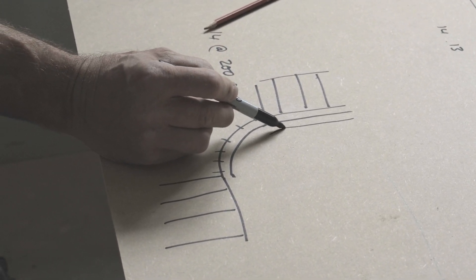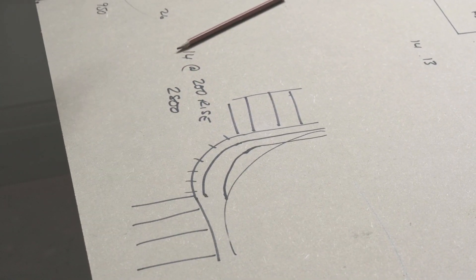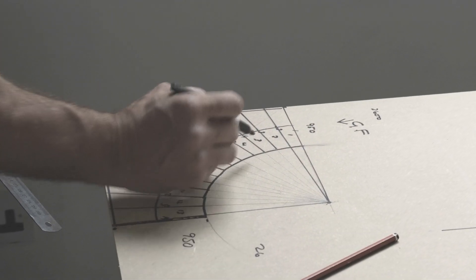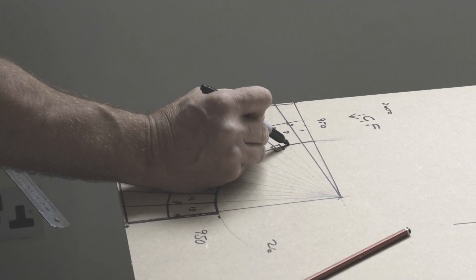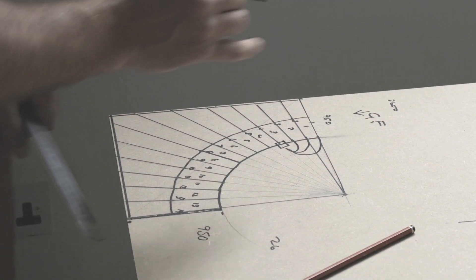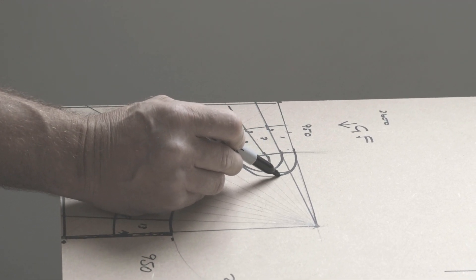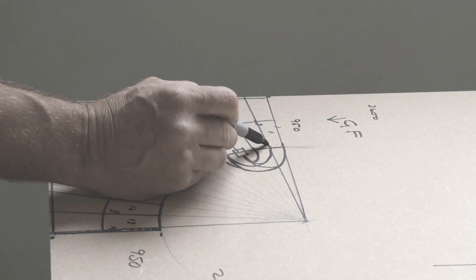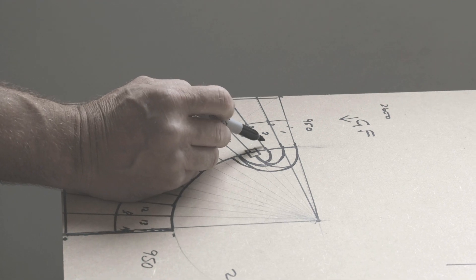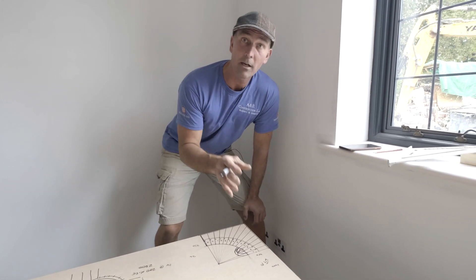Because I like to draw and visualise it, I can eliminate mistakes. When I first drew the staircase out I had it originally straight, then a curve, then straight again — but I didn't want the handrail to come up with a slight awkward kick, then curve beautifully, then have another slight kick. I thought, wouldn't it be really nice to have a lovely constant curve? That's what we've done. We've designed it to have that lovely constant curve, and we'll come in three treads and have a massive 1930s newel post with lovely sweeping treads. Please leave your views and comments down below.